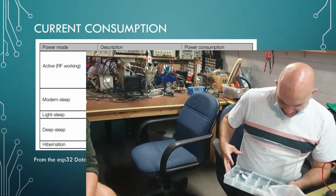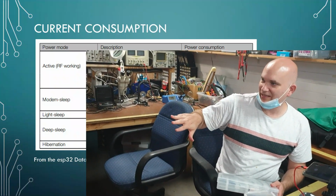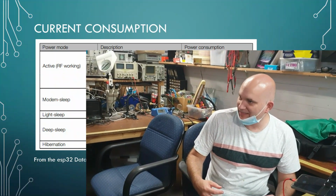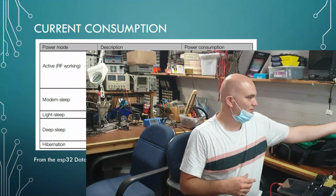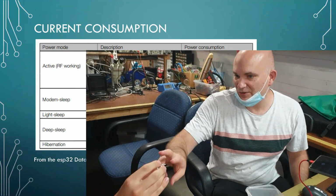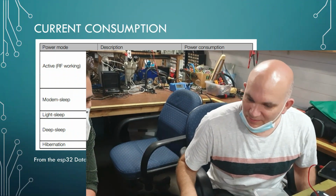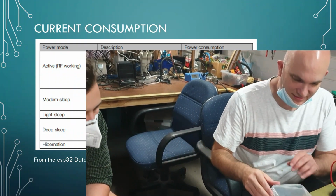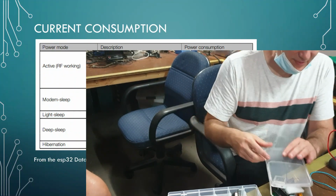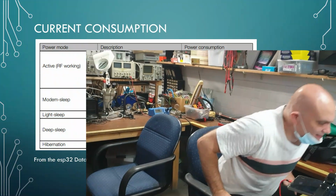I2C and SPI are 2 buses that are common. SPI uses 4 wires, I2C uses 2 wires, and you can drive just about anything with them, from displays to temperature sensors to everything. Is this SPI? No, that's not SPI. That's actually just normal touch. That's just a closed and open circuit. Most of these things over here are actually just open and closed circuits. I don't have any screens or anything else like that. But touch screens and all that sort of stuff, those are usually SPI.